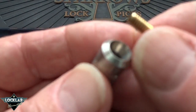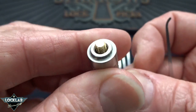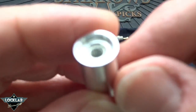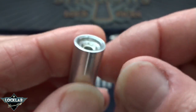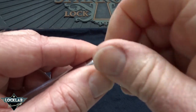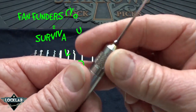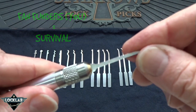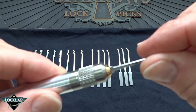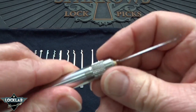The brass insert fits beautifully — it's tapered to fit. If you look at the back of it, there's a step-down cut. They didn't have to do that, but inside is a notch-down area that it fits into as well, giving a really good compression fit and tight gripping. Half a turn, you slide the pick in, and then literally half a turn and that thing really is not coming out. Even loosened up, you put it all the way to the bottom and it just barely moves. Very precise machining on this thing.